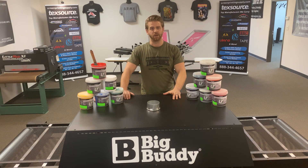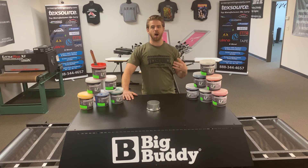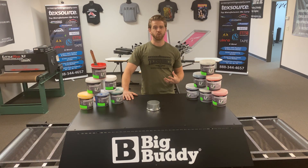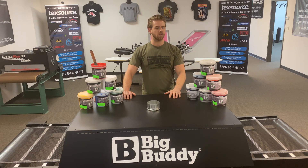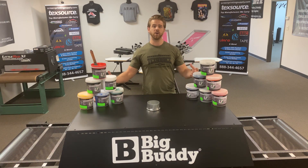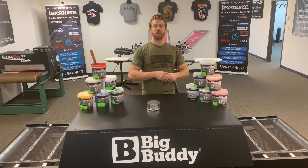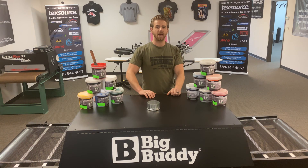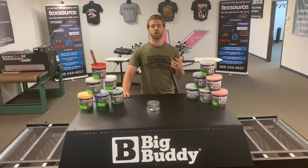Because of the way fabrics are made, a lot of synthetic fabrics — your tri-blends or polyesters — have a lot of problems when cured up to 320 degrees. The fabrics have a lot of dye migration, so the industry is moving towards low cure inks to prevent dye migration, as well as a lot of athletic shirts that tend to shrink when cured at 320 degrees, and certain color shirts can even melt.